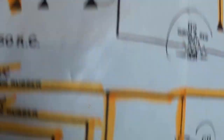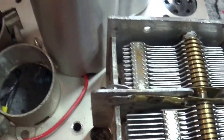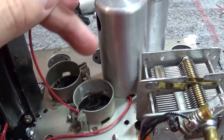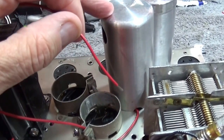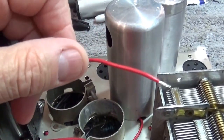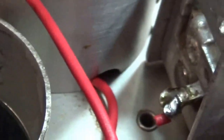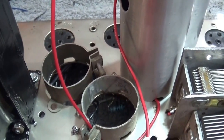Let's go over to the chassis. So the wire that we're talking about here — the wire that goes to A1 — I've actually run it down in the bottom of the chassis, so I'm bringing it up here just to show you. I'm going to have to lift this cover off when I actually connect it, which I'll do this weekend. Basically, what happens is this wire goes right here to the tuning capacitor. Let me zoom in there so you can see that — that's right there to the tuning capacitor. So when we look on the schematic, which I'll bring up again here...